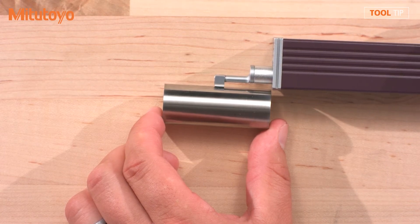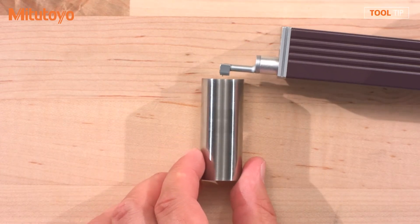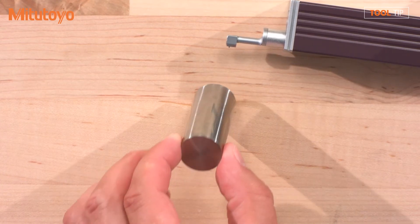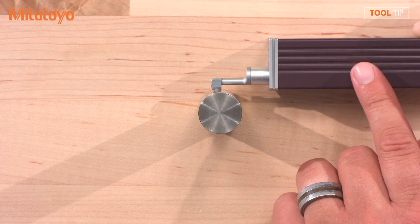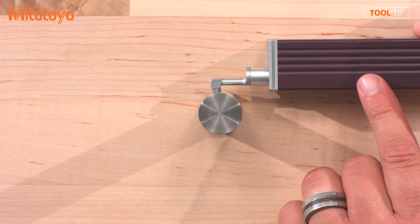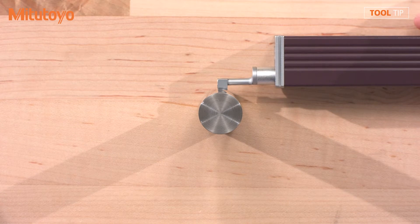That's important because the skid is the datum, and if the datum isn't making good contact with the part, you get an inaccurate measurement. So if you were to measure along the axis of this part, you'd be fine. If you wanted to measure the top face, you'd be fine as well. But if you wanted to measure radially, that would be an issue with the skidded system. As you move the stylus back and forth across the part, depending on where you are, either the beginning or the end of the skid are going to be off of the surface, causing a gap — and since that's the datum, it's not making consistent contact with the part.